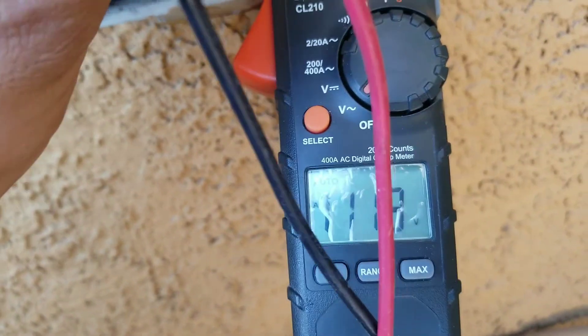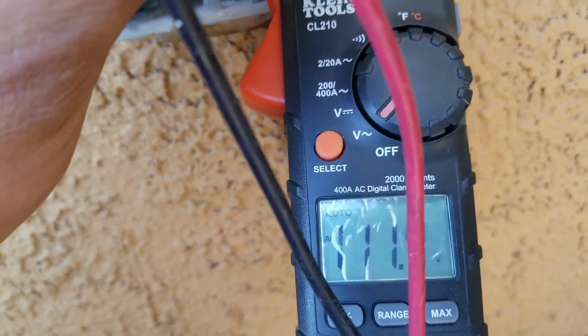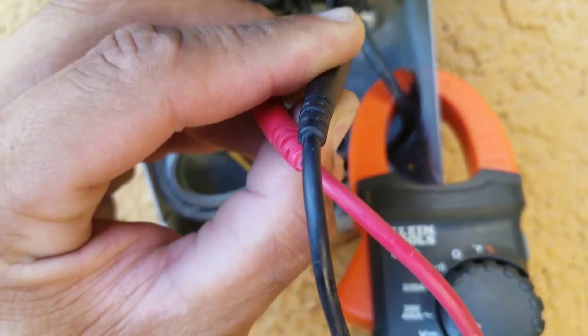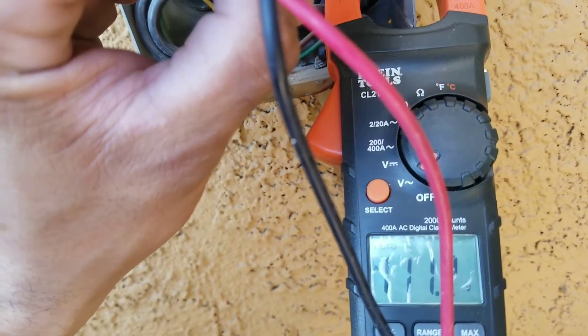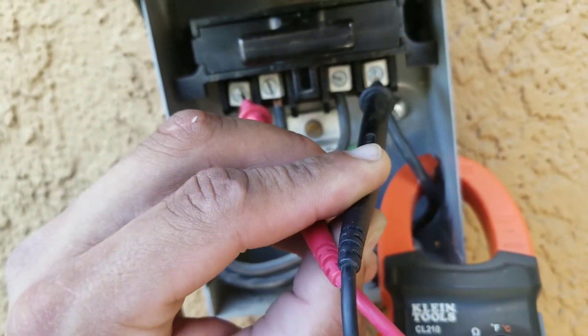So I'm going to go to my breaker and see if my breaker is getting power. The breaker feeds power directly to this disconnect, and at this point I've eliminated the possibility of the contactor being bad — I know that I'm losing a leg from my disconnect.